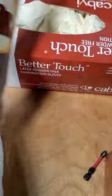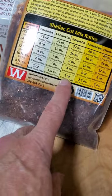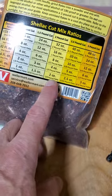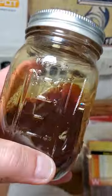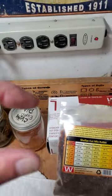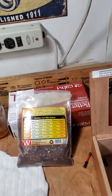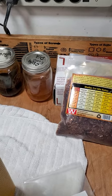Wellamart has its own website — the back will give you a rundown on how to do your mixes. I'm doing 2 ounces to 8 ounces — it's a 2-pound cut. Very simple. I just use one of these mason jars. The jar has an 8-ounce mark. I fill it with 2 ounces of flake measured by scale, then fill it with denatured alcohol — a little bit equal to it or a little bit higher.